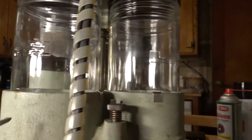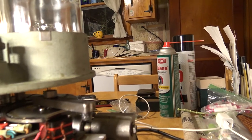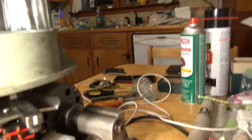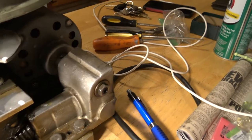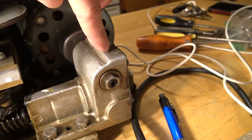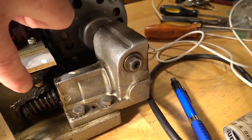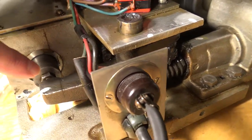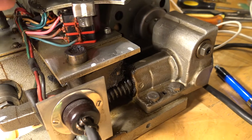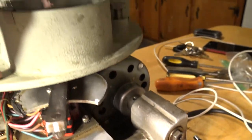And then there's another switch stacked right below it, and that controls the motor for the hydraulic pump. Going around to the back side — I'll move my light so we can get some good lighting — here is this massive electric motor which runs a pump and a worm gear that performs two operations: it controls the hydraulic pump, and it also turns a turntable arm that's going to rotate the table with the jars on it.